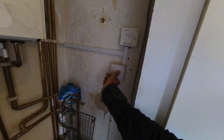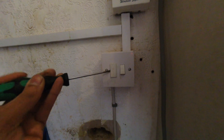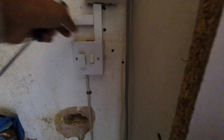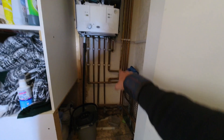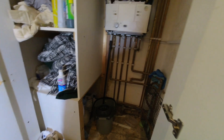The case is off the boiler. First thing we want to do is flip the power off and take the fuse out, because we don't want that to accidentally come live again. Just pop the fuse out. Now there's no power going to the boiler. I'm probably going to put the condensate pump about there, because I'm going to punch the hole in between the boiler and these pipes somewhere around here. We'll run the condensate and the PRV straight into the condensate pump. I don't think I've got any condensate tee, so I'll probably just use two of the entry points on the condensate pump.